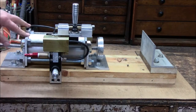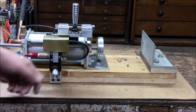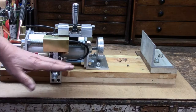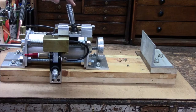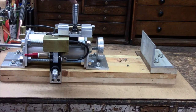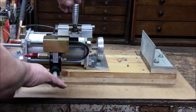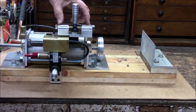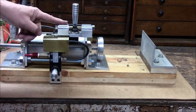The valving was the more difficult part of this. This was a real straightforward valve — I had this one in stock and it's momentary. Push it down, air is admitted up to this point. Let it go, the air is cut off. This other one I had in stock had detents. It's a center off but it would click and hold when you pushed it this way, and it would click and hold when you pushed it the other way. I didn't want that. I wanted one that returned to center so that at no time could it be engaged. You would have to use both hands in order to make this work. So what I did is I came up with this little mechanism here. It's got a couple of brass pins that are spring loaded, a couple of grub screws on the end pushing in from each side to supply the preload.